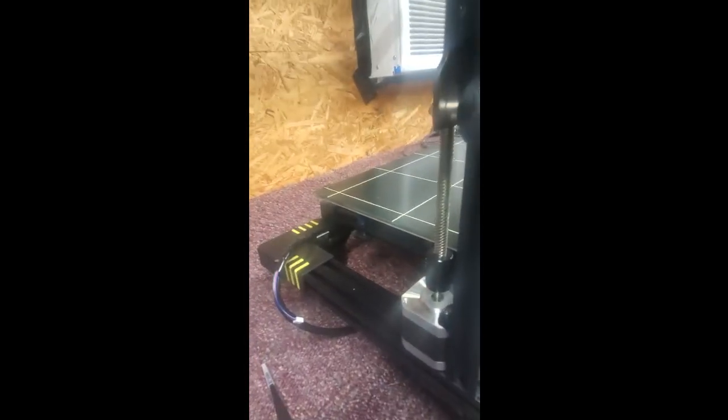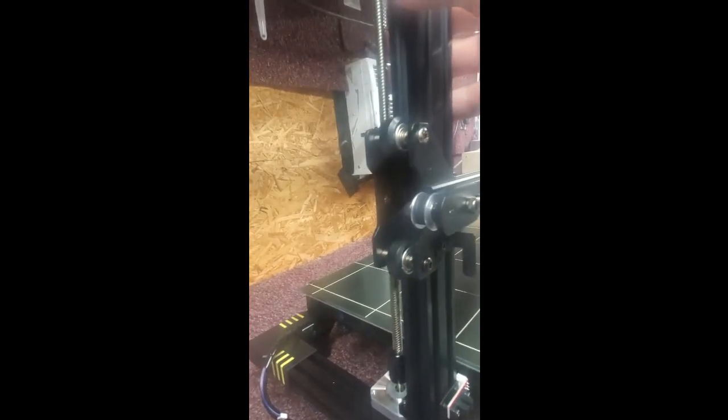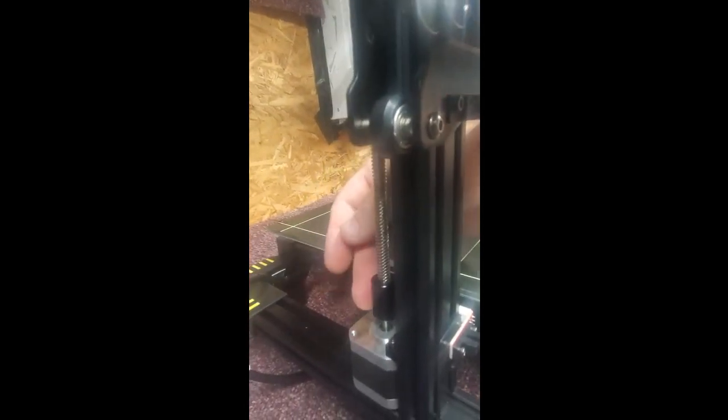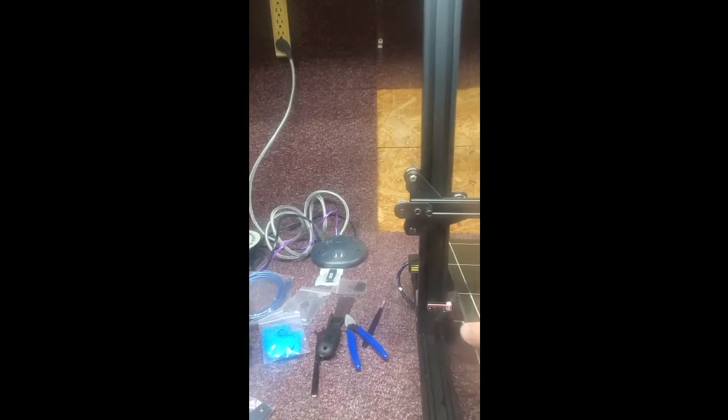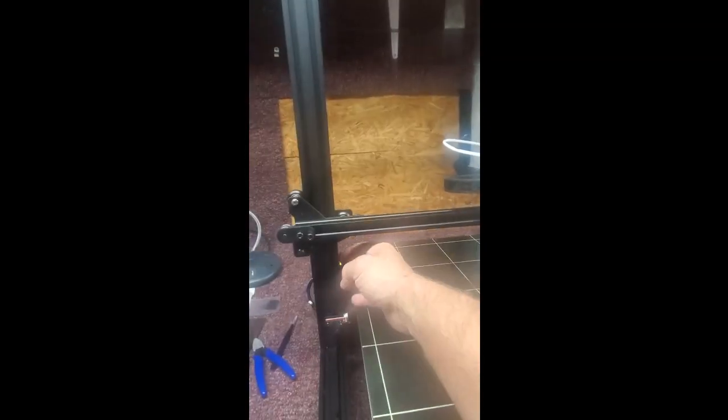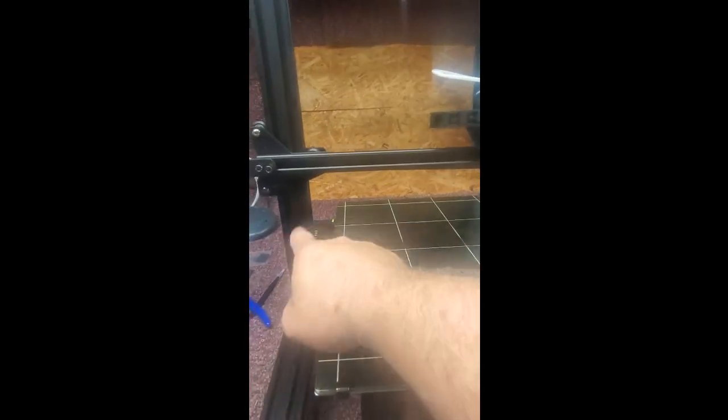One of the things I had to do before I could set this frame on top was to rotate this one and the other one on the main frame piece to bring the whole gantry up, so that it would clear this space here — because it was all the way down and it would hit the bed and I wouldn't be able to get everything in. So don't be afraid to turn these. You want to turn that one and the one on the other side at the same time if you can, and just gently raise it up — four, five, six, eight inches — whatever you need to give yourself clearance so that this bar isn't hitting the table when you're trying to hook all this together.